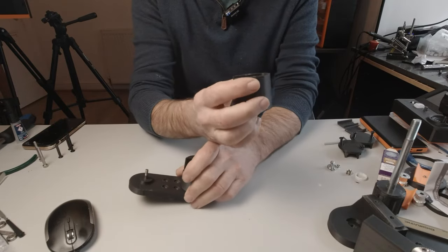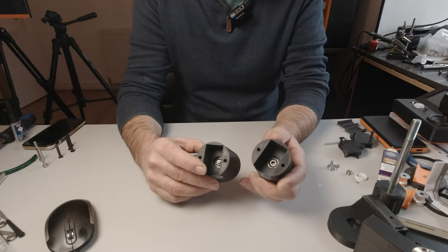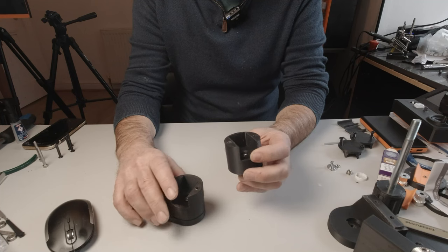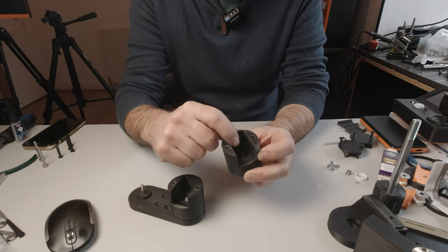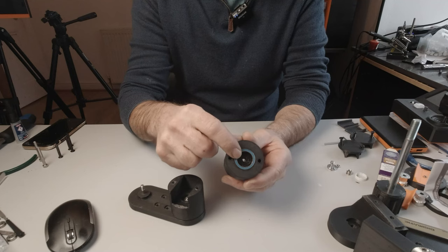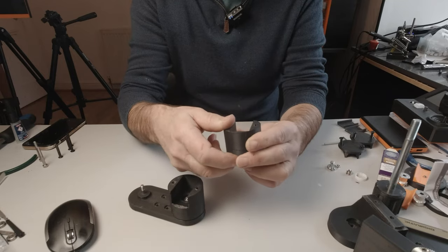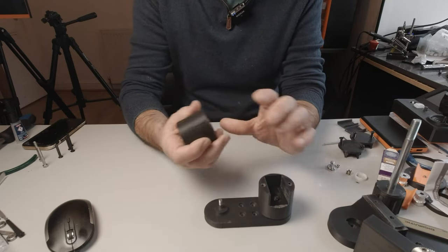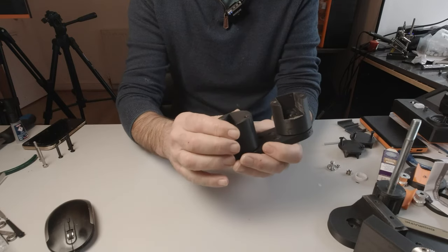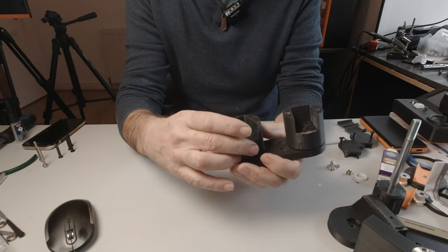Take these two identical cylindrical seats, both numbered 032-60. As before, press in a 5x16x5 bearing into this face, and on the other side press in a 20x27x4 bearing. Once you have those bearings in place, add these to the bearing plate as you press down, and lock them in place with two M5 nuts over the end of the axles.